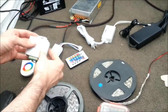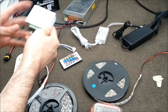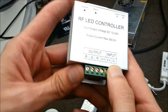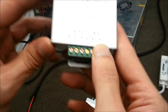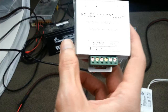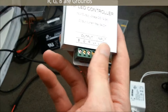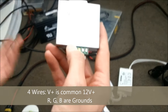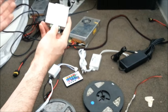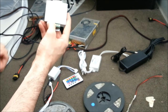On this particular RF controller, you will need to do some wiring — you'll need a screwdriver and possibly some wire cutters. You will see there is a V+ and V minus; this is the input voltage, 12 volts, from your power supply or battery. In your car, you will not need a power supply — these are only for home use to connect to your wall outlet. The output on most RGB controllers will be B, G, R, V+. B is blue, G is green, R is red, and V+ is the common — it supplies common voltage while the controller turns the three colors on and off to give you the effect.